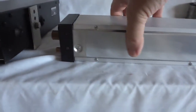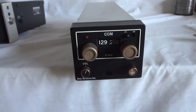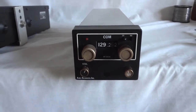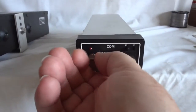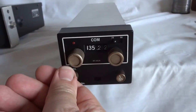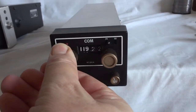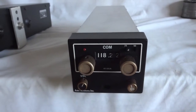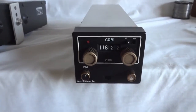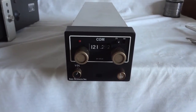This is the RF connection. It's a neat little radio — these are very well known for their reliability and will last forever. You can use it in a plane or as a desktop radio, perhaps for a small airport. It covers the whole band; 135.975 is the highest frequency. The area from 108 to 118 megahertz is the nav band for navigation. Let's put it back in the tray and listen a bit more.